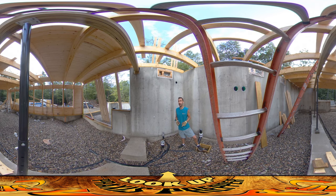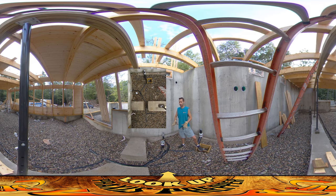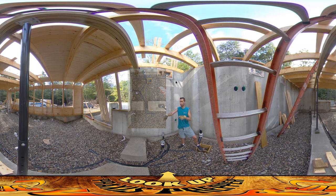Before I do that, I'm making sure I'm taking photographs of everything that's down here under the slab. Very easy to do now, very difficult once it all gets covered up. I went up high and got nice flat photographs looking down, so if in the future there's ever a problem and you have to dig down to get to them, I don't want to do a bunch of exploratory holes trying to remember where all the pipes ran. With the photographs I can go back, refer to them, and know exactly where we need to dig.